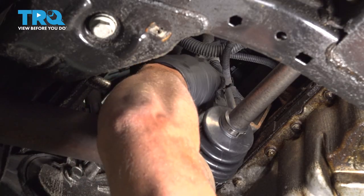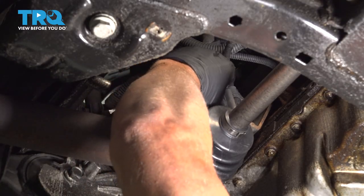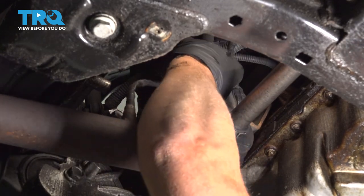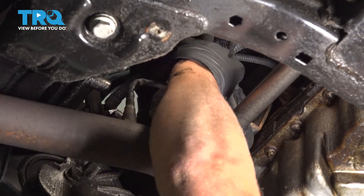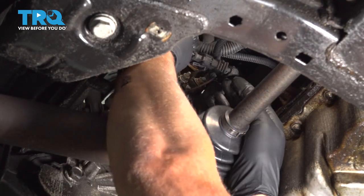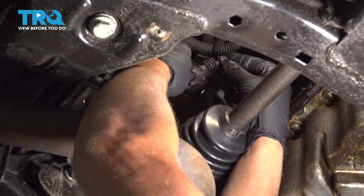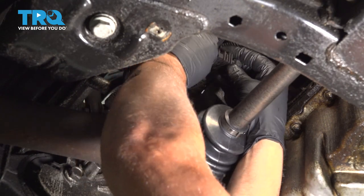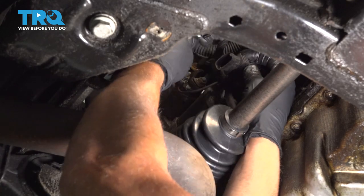The connector is up here. I'm just gonna slide the connector out of the bracket, just gonna push it up. That should slide out just like that. Then you can access the clip — just push down the release, slide it off and slide it up.